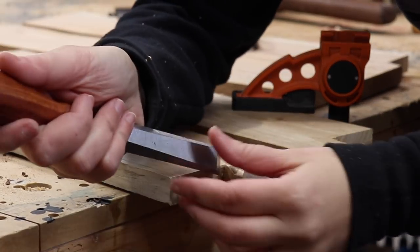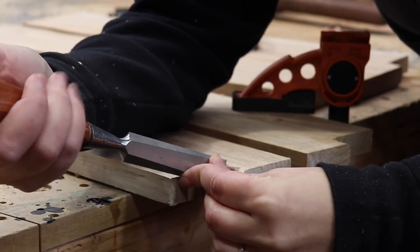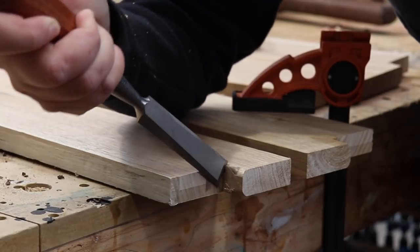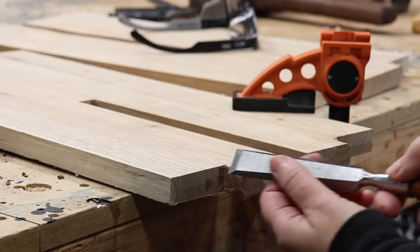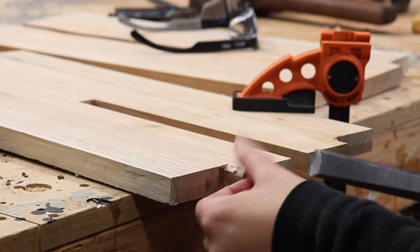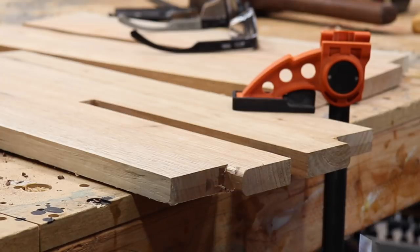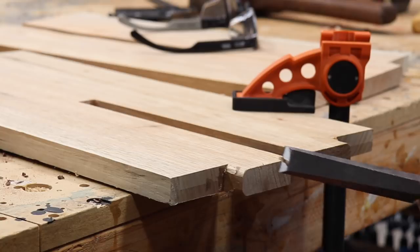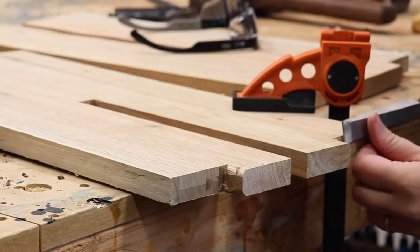The first thing I want to do is take the chisel, keep it flat against the shoulder part, and dig it in — creating a cut that's cutting the fibers of the wood. Now when you pare down from here, it's just going to break off right by those cuts, and it's very easy to pare away the wood. Even if this is not perfect, the top part is perfect because of the round over bit. Repeat to all the other sides.